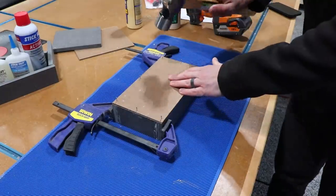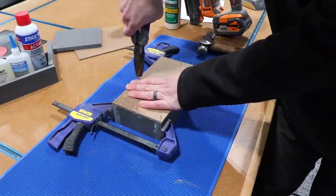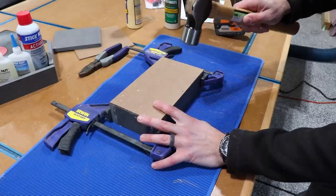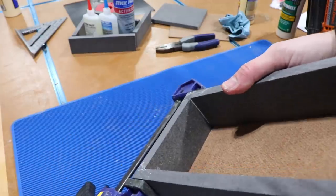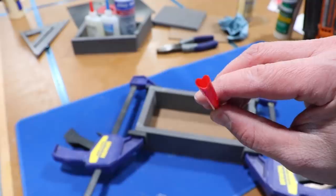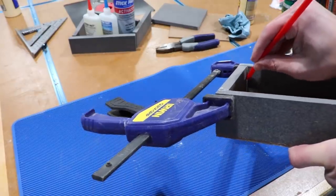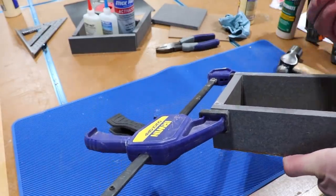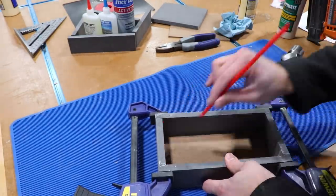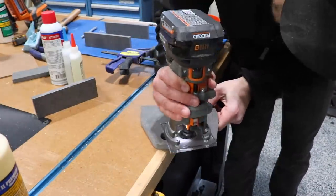The brad starter strikes again — this dense MDF makes hammering in brads tough, so I ended up twisting off a bunch of the heads that bent on me. Here's a cool find: you know how you can remove excess glue from inside corners by scraping with a straw? Well, I found these heart-shaped straws and the point of the heart makes an almost perfect shape for doing this task. Check the links in the video description — these may be worth checking out; you just have to explain to your buddies why you have heart-shaped straws all over your shop.